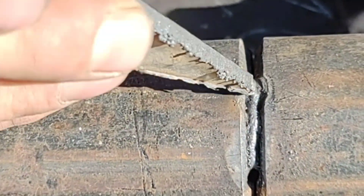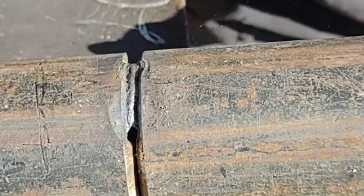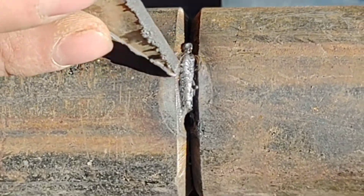I'm here to teach you guys how to read the tack and understand the tack. Because sometimes you might not be able to see what's going on inside the pipe, and you've got to know from the outside. So if you're running weld somewhere and it's looking like that, you need to know in the back of your mind it's not in there.